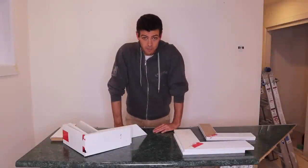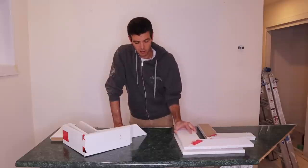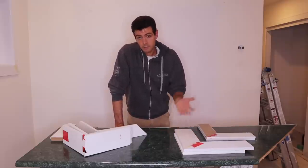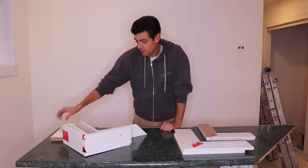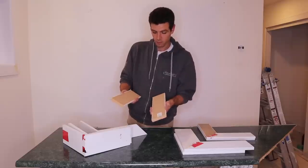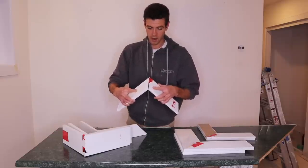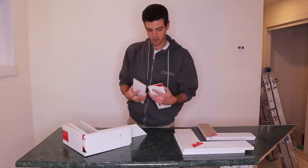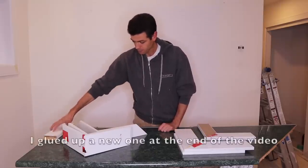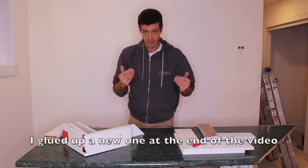It's been more than a few days, so that's a good thing. We've got lots of time for the wood glue to really cure — it's not wet at all. Let's bring you guys up closer and start breaking these apart. Unfortunately, the only one that didn't work was my regular MDF baseboard — I accidentally pulled the tape too tight and it left it open at the front, so there wasn't any glue in that joint. We still have the cyanoacrylate baseboard one though.